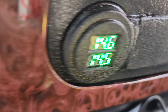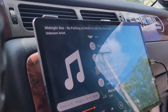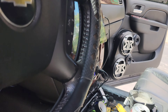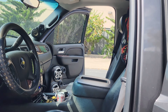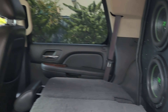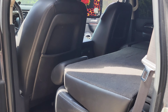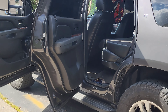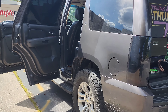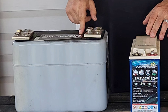This is why when you see someone doing an amp dyno, the dynamic portion is really what you're looking at. That dynamic boom when a bass note hits is subject to how much instant power you can provide the amplifier board. If your capacitance is low, it's going to be a soft hit — you'll hear it come in and get strong, but it won't come in with a slam. Amplifiers with small capacitors don't have much dynamic headroom, whereas boards with lots of big capacitors do. That's where this comes in.